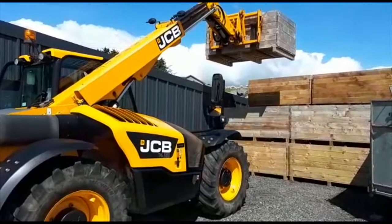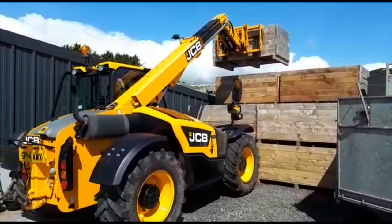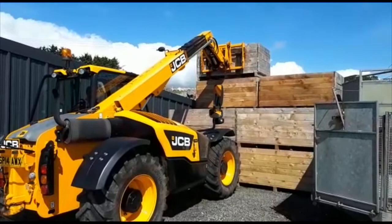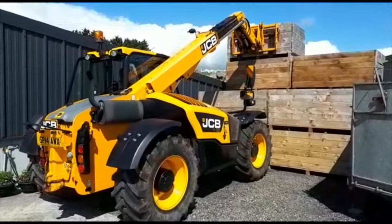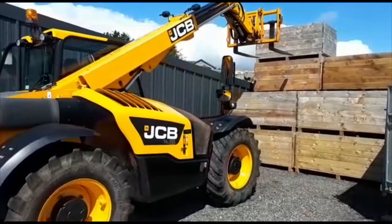So likewise, when you're doing high stacking and you're extending the telescopic boom, again that's all done with a handbrake on and the vehicle safe and neutral. So you position yourself over the top of the stack there, handbrake on out of gear, lower yourself down. If need be, you can retract the boom, take your tilt off and lower the box down. Again, when you're coming out, you might need to make minor adjustments, that's fair enough. Again, observations checked before he comes back. He gets himself clear of the stack and he retracts his boom and then lowers the machine back down into his travelling position again.